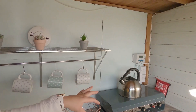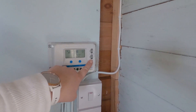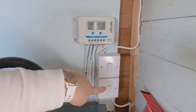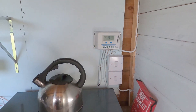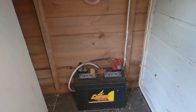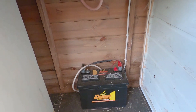This is the hub of it here — the charge controller. We've got two USBs here so you can plug your mobile phones or whatever in, and then this all runs to switches which do the lighting in the toilet and the lighting in the dome. Under here — mind the spiders — is the leisure battery. This battery has lasted about four years.